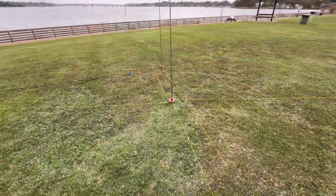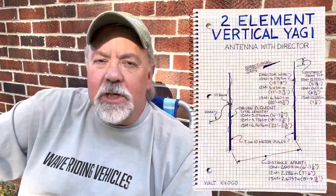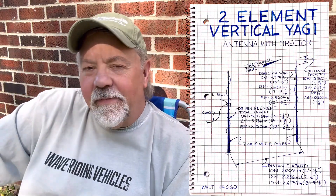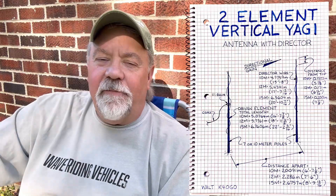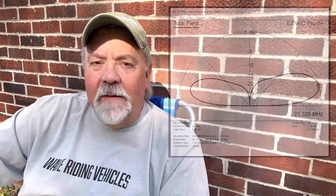Hey guys, I've got another multi-element antenna that I've built. This one's a little similar, a little different than some of the other ones. Before I did a reflector behind a vertical on the ground — basically a quarter-wave vertical with a reflector — that was a true Yagi, two elements. What I'm going to do is a center-fed dipole as the driven element with a director, a smaller director in front of it. I've looked at a lot of different texts on this and modeled it as well. There is more gain from a director than a reflector at this size of antenna, so I put one together.